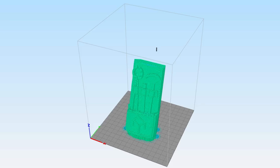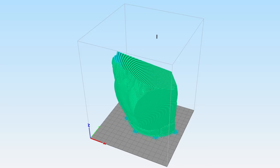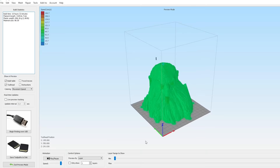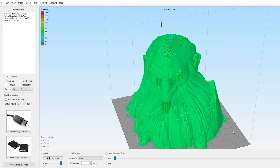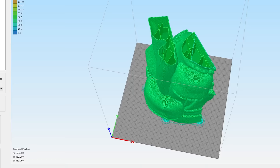As we planned to make the post-processing with a surface finish on the parts, we prioritized the printing speed, and changed the printer nozzle to 1mm, and layers from 0.3 to 0.5mm thick, with two perimeters, trying to minimize the use of infill and supports on parts. The beginning of this 3D printing process is similar to the resin one, with the slicing of the parts in a software, in this case Simplify3D, where specific profiles were made for each part, and where we varied the percentage of infill and the quality of the part, according to the complexity of the piece.